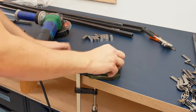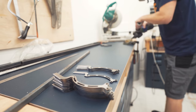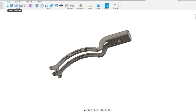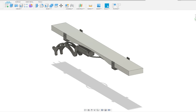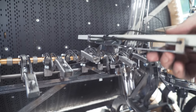At the moment I'm preparing the parts for the vibraphone plates - the holders. I have to clean the edges and make a little chamfer on them so I can weld them together, and that will look like this in the end. There you can slide the vibraphone plate on, and this will get attached to the machine. I have to weld them together, drill a hole in there, and tap that hole, and then these parts are finished.